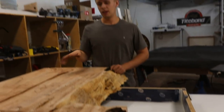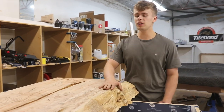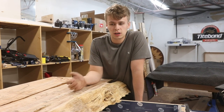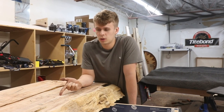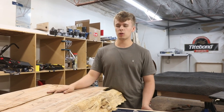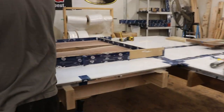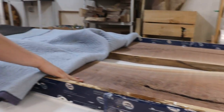In the pour room, here's the four-inch thick quilted maple I was telling you about. Normally people can't pour to this thickness in a single pour — even another big table maker on Instagram making a four-inch table has to do it in two pours. We're going to do this in a single pour, partly because of a new product that's in the works, but also because of our air-conditioned room with aluminum molds — the aluminum pulls out the heat generated by the chemical reaction, so we can do thicker pours than recommended.